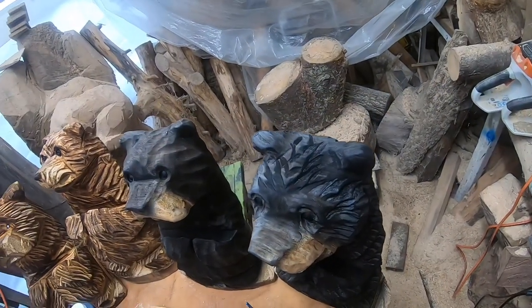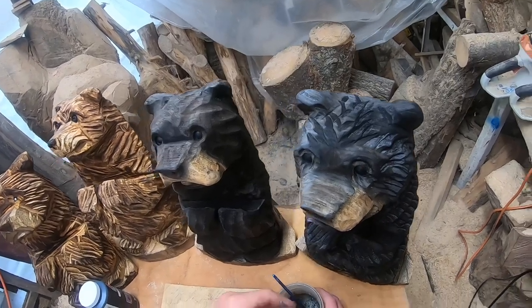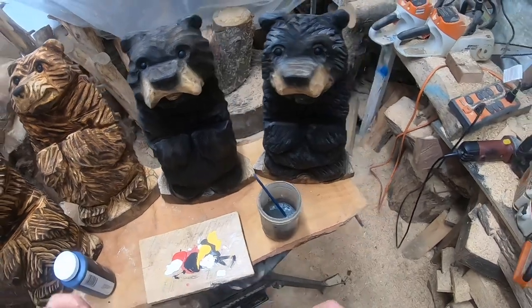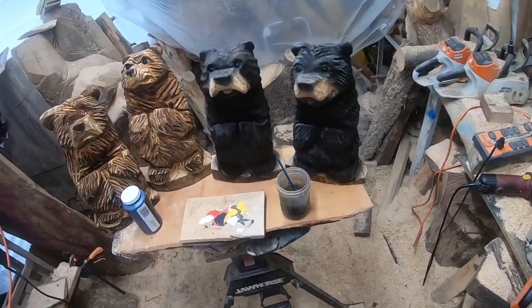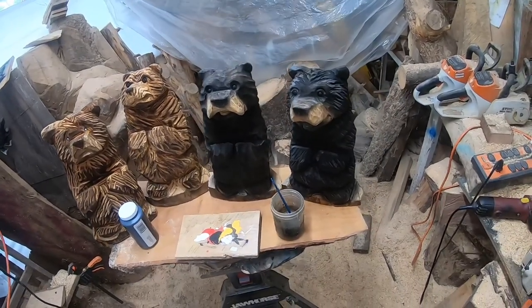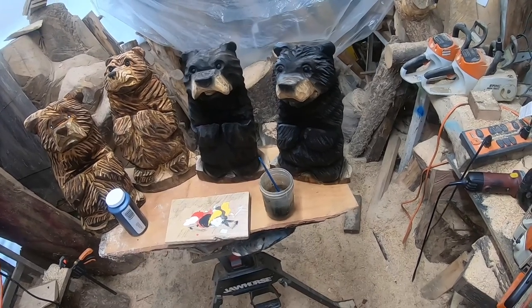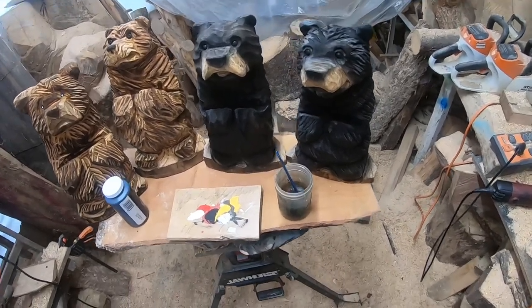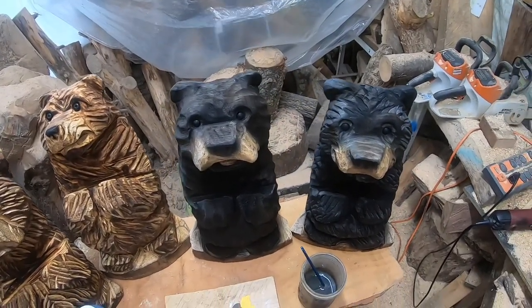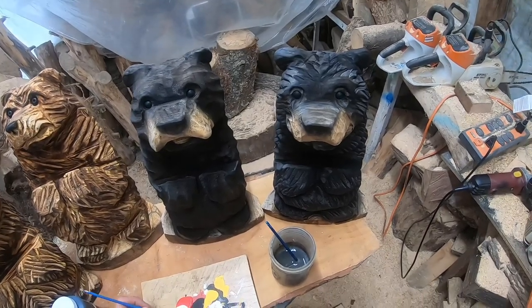The acrylic one is a little bit different. The acrylic one I spray, and I'll spray one to two coats on pieces like this. Now, if it's a big order for somebody, a nice tall bear that someone's ordered, I will brush it on. If you brush it on, you have thicker, heavier coats. You spray it on, it still gives you a good finish for bears you're going to sell at fairs and things. So the oil based, it's more chemicals and things in the air. The acrylic is water-based, so that's why I spray it. It's a little bit safer.